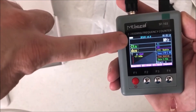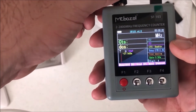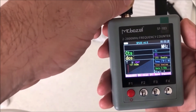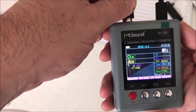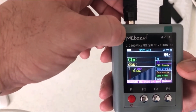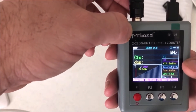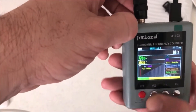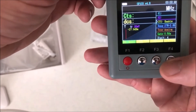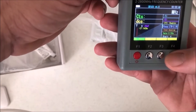We got a 4.8 software revision, a counter run-down, battery indicator, charge light, and we're already set up. We got the CTCSS tones and the DCS tones — both of those would show the frequency coming up top and display if they're using tones as well. It's enabled. We're already in scan and we're in 27 MHz.